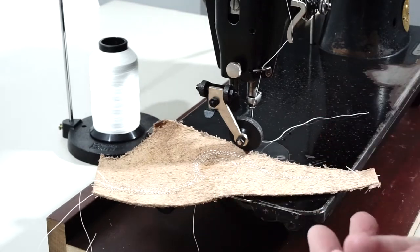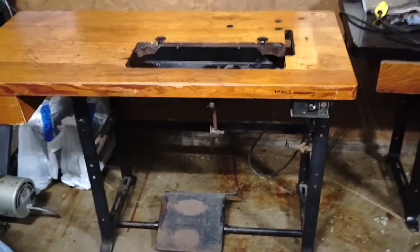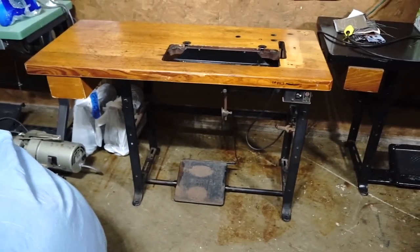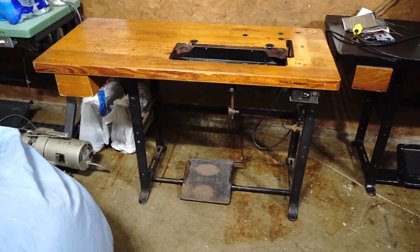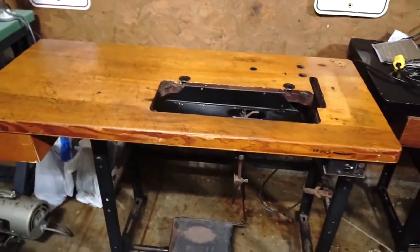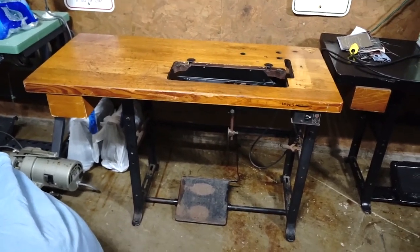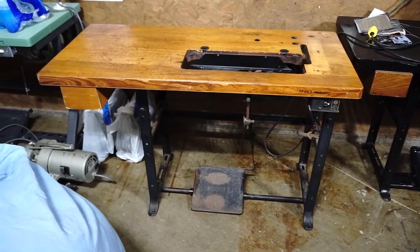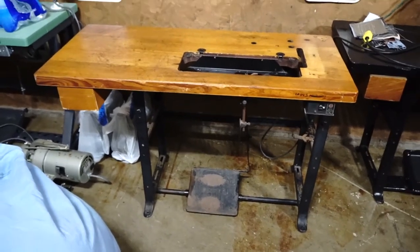There's the original table. This machine's serial number date code puts it at 1949. I fixed up the finish on the table top a little bit, took the motor apart, took care of cleaning the clutch pads, greasing the bearings, and putting new grease in — there's a grease pot that you need to fill and tighten so it loads the motor with fresh grease.